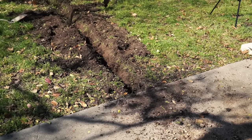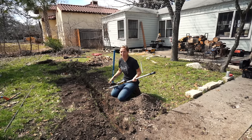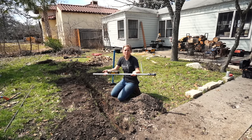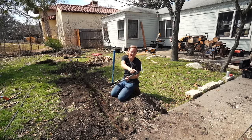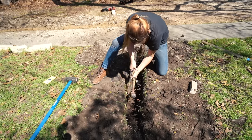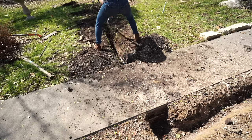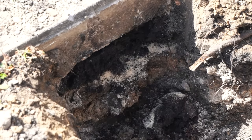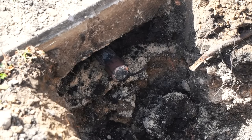After getting the trench all the way done I next focused on tunneling under the sidewalk. The trick is to use a four-foot piece of metal conduit. On one end I have a cap taped into place to prevent dirt from getting into the tube, and on the other end something is protecting the threads. I use a torpedo level to keep it nice and level, then a sledgehammer to persuade it through. After showing this on Instagram, people suggested hooking up a hose to remove dirt with water — it sounds messier to me, but keep it in your bag of tricks as an option if hitting it is not working for you.